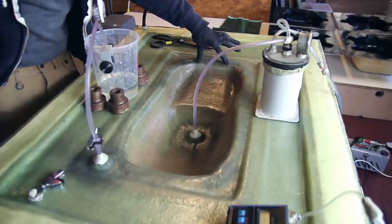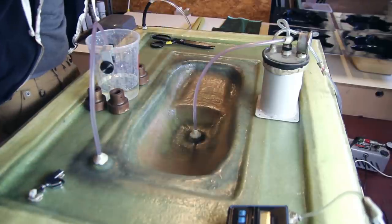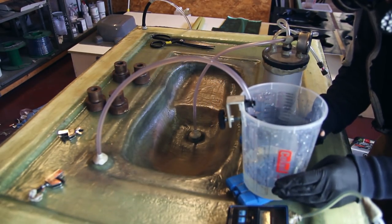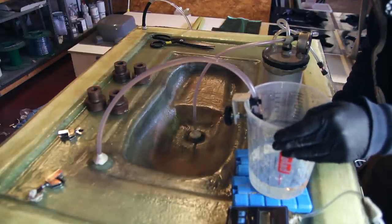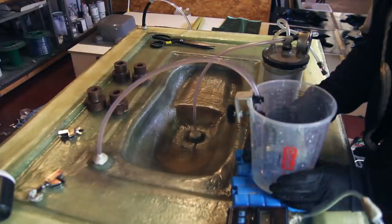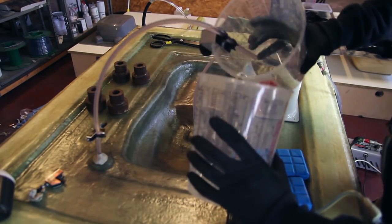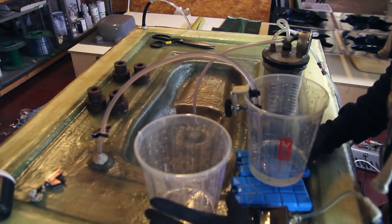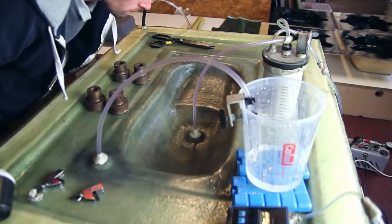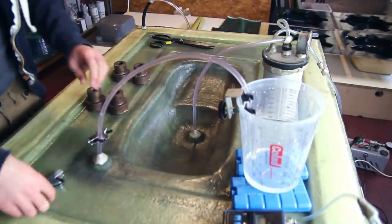The perimeter was filling well, then the resin should infuse all the way through the middle of the part — but I noticed this was going quite slowly. That's somewhat expected since it's essentially infusion without an infusion mesh, which slows the resin down. A useful tip: to avoid exothermal reaction, cool down the resin as much as possible and avoid having too much resin in your cup, because more volume reacts faster, creating a chain reaction that accelerates even further.